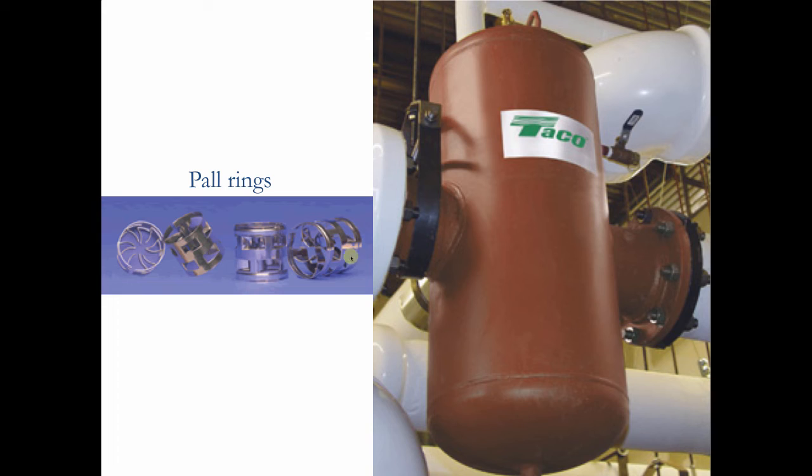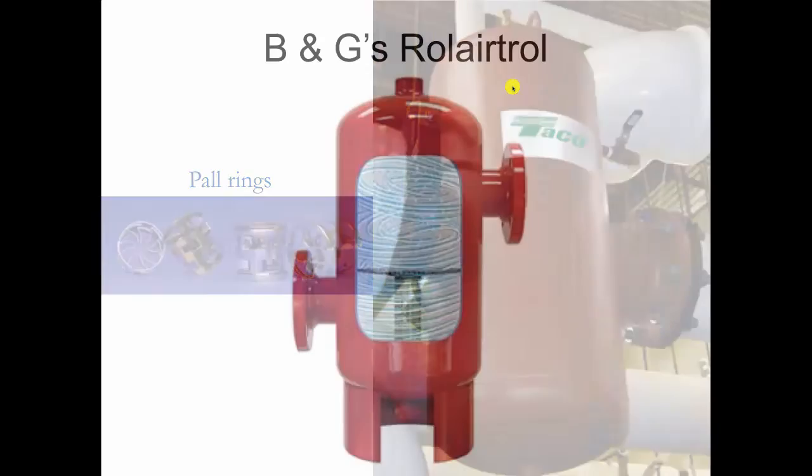Taco's got a big air separator that uses these Pall rings, which are very tiny, and this probably holds thousands of them. And again, the air separator is nothing more than a wide space in the road. When the water gets in there, it has to slow down, and the air bubbles will collide with and cling to all these little surfaces that you see in here. So this whole air separator is just loaded with these things right up to the top. And then the air gets into this quiet lagoon away from the flow and just comes right out of a high capacity air separator, and it's gone from the system for good.